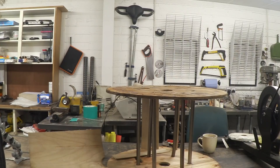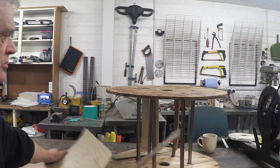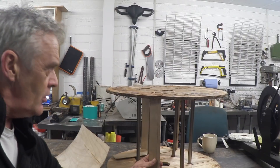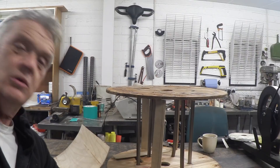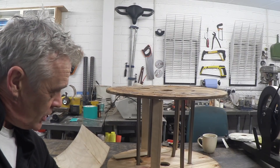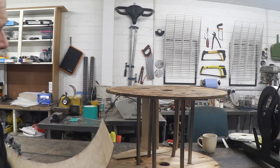The central core was made out of plywood wrapped around steel rods, and I've removed the plywood. I'm cutting it into five centimetre strips. Because it's been sat curved for a long time, it's got a slight curve to it. All I'm going to do is stick those five centimetre strips on like a squirrel cage. The angle I'm just guessing — it looks about right to me from all the other squirrel cages I've done. So I'm going to glue those in there, clamp it down, and slice the rest up into five centimetre strips all the way around.